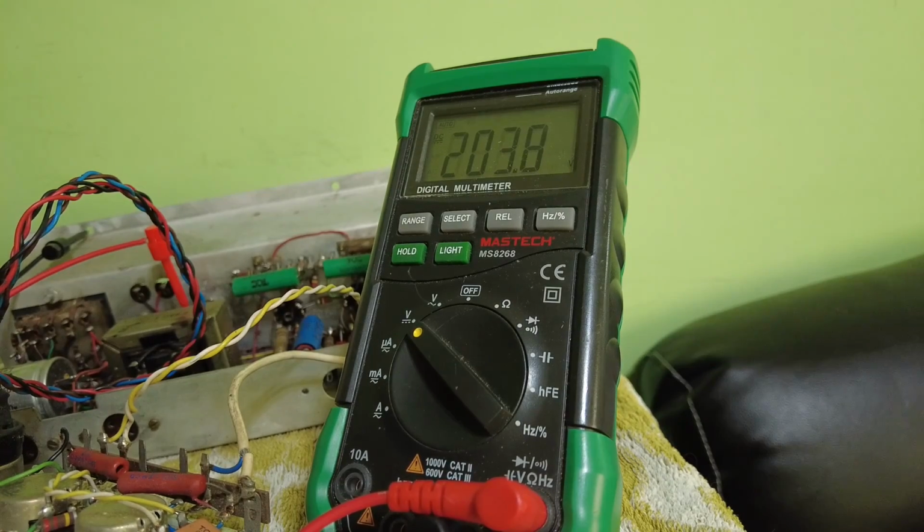The cap's rated at 350, and that is actually the same capacitor, I think, that was in that Bush, with the surge of 450. In actual fact, that's milliamps, not volts. Yeah, ripple rating 450 milliamps. You don't often see ripple rating on capacitors now.